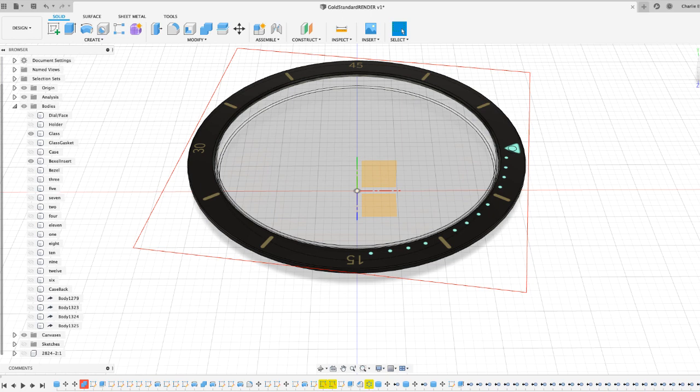If you look at their Supermarine, you'll see that they have a very linear matte bezel insert, which is exquisite, really. So in order to achieve that, we're going to experiment with bead blasting, brushing, combinations of both, and basically do what is necessary to get that level of finish on the bezel insert. I mentioned in the last video, I'm totally fine with highly reflective polished ceramics. I think for this piece though, the matte thing is a little bit more classy.